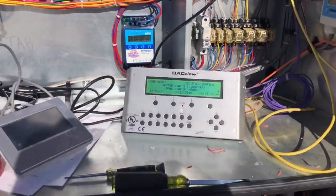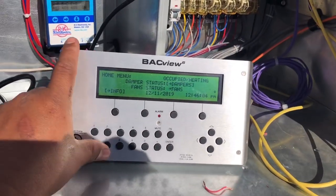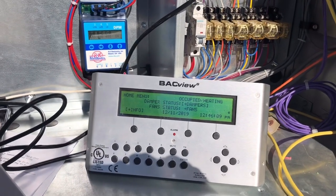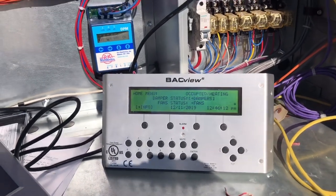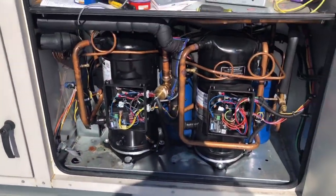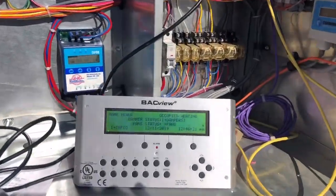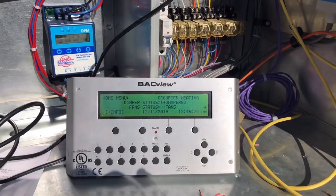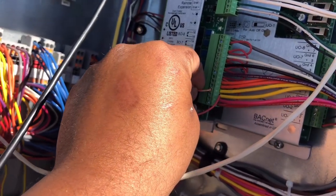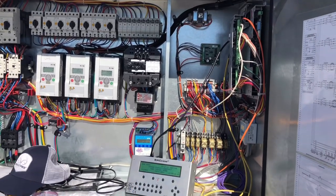This type of controller is not very user friendly. Apparently that's why the other technicians couldn't get this compressor to cool — our ambient temperature is below 55 degrees. Whenever we're below 55, the system will not run in cooling mode. Right now it's just running in heat. You can see right here, I can jump it right here — the compressor keeps on. I'm going to have to take a few minutes to figure out how exactly I'm going to do this.